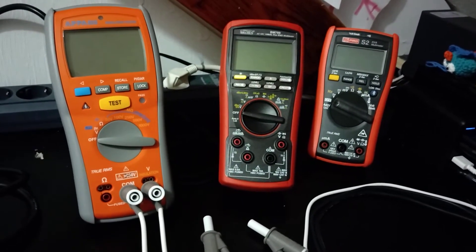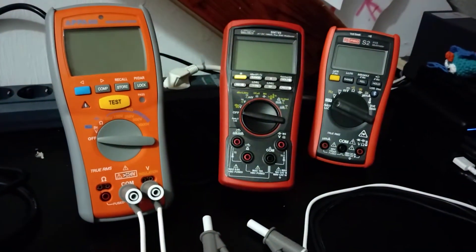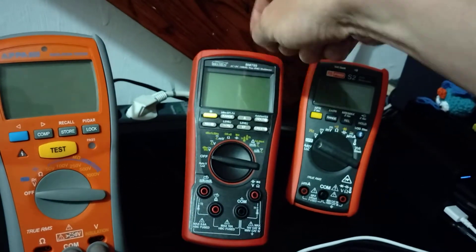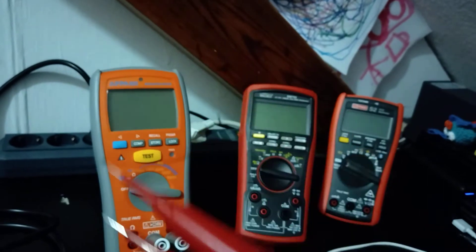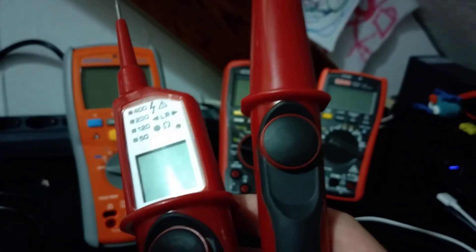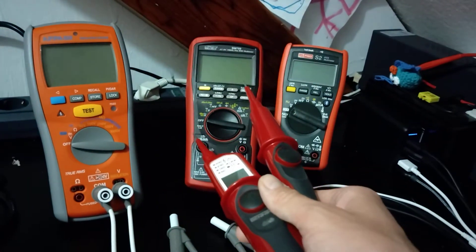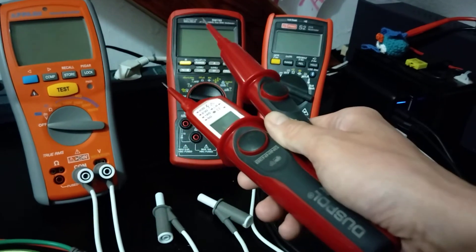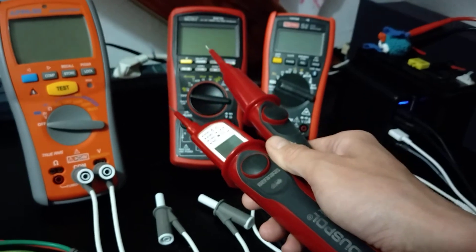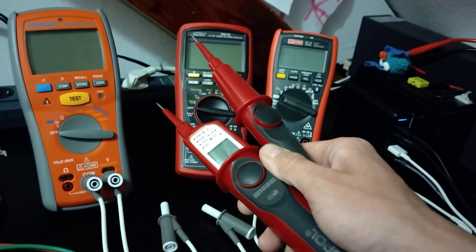Why would I have it on a meter? Of course, it might be a nice add-on. But one obvious side effect is that when you have a shielded meter — you know how this Brymen looks on the inside, very nice shielding — but not right here. You don't want to have shielding around your antenna, obviously. So what to use instead? Something like this. It's not so difficult. There are optimized tools. Why is this so different from a multimeter? Why not just check with a multimeter if there is dangerous voltage or not? First of all, you see how many buttons this thing has — it's very easy to configure it wrong, to have a filter on, to have it set to DC while you try to find out if there is AC, to do all kinds of weird things. The batteries can run out while you try to do something — batteries run out and then you just guess: 'Safe, I switched it off, it's gonna be okay.'